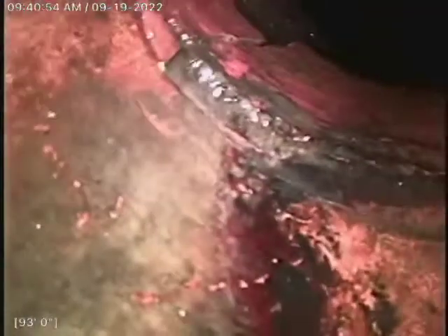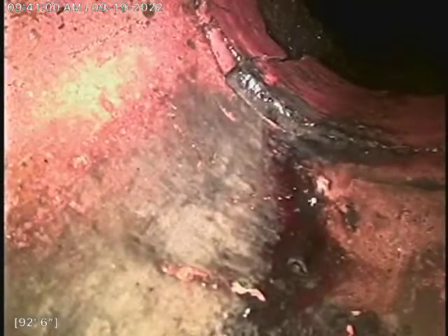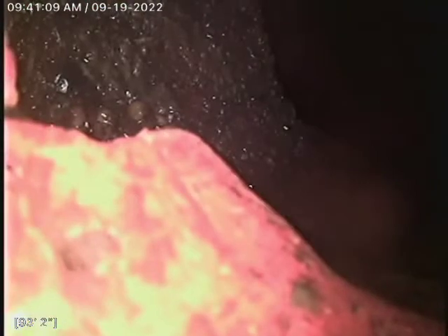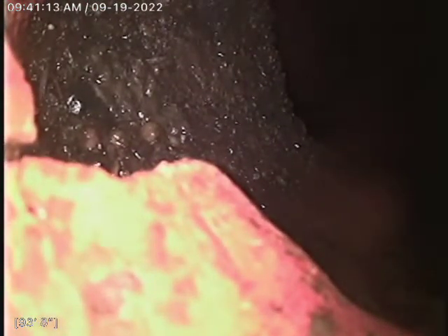Here at the end of the lateral, what I can see from running water and flushing out whatever roots I did cut out in this line, is that there is a slight crack right over here in this joint. I'm not sure where it ends, but you can see where it starts there. We are tapping into the main already.